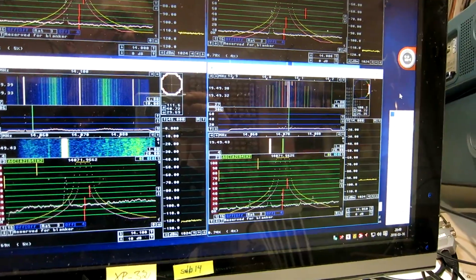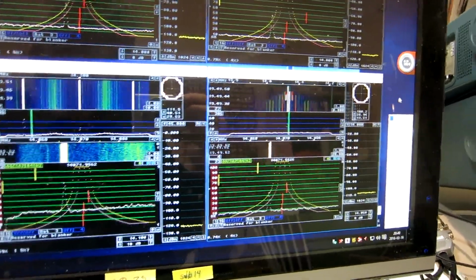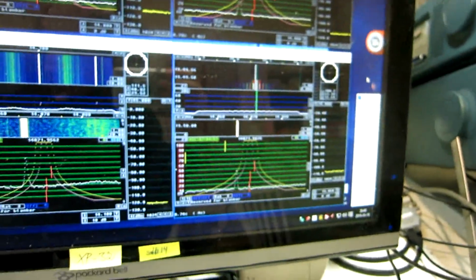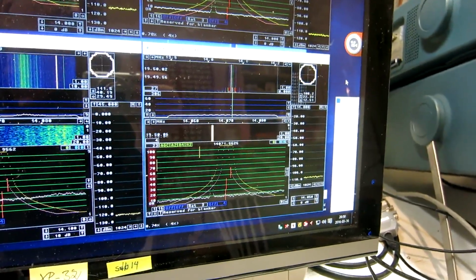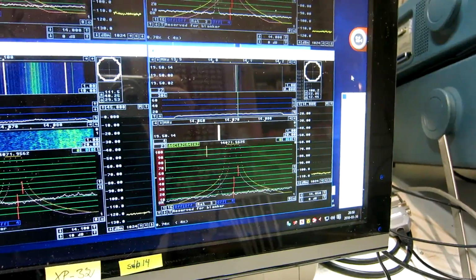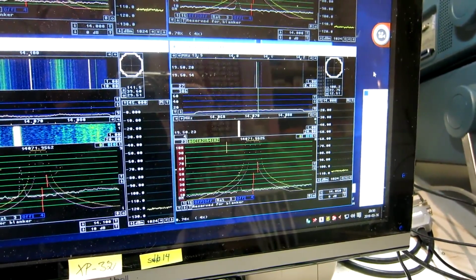That is more attenuation, and again. And again. I have to go all the way down to, what does it say? Minus 80 dBm to not see anything of the overtones. It means there is no front end filter, and we have digital feedback from the data lines. This isn't as bad as it looks, because if there are many more stations on the band, this will cause dithering and spread these things out.